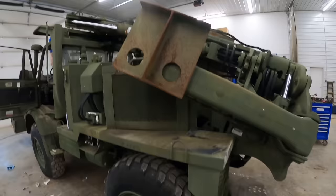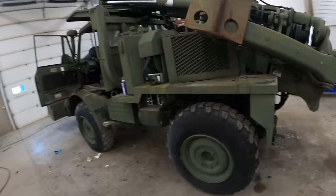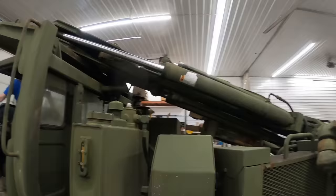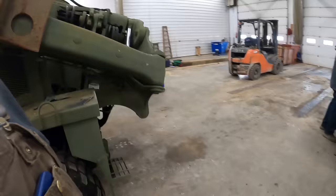These are actually boom locks here. They're actually in the down position. So when we get it going, we'll raise those up. They actually come in and clip over that hole right there. There's a boom lock up here. You pull this handle and it moves the boom lock. So right now that backhoe's swiveled over in the storage position. There's a cylinder down in there that will lay that backhoe plumb up with this lever right there. Fold out, and like I say, that's a regular Case series backhoe, like a C or D model backhoe.